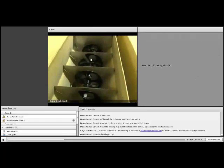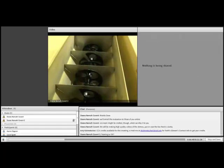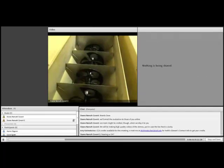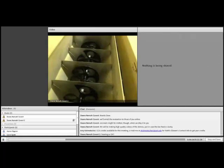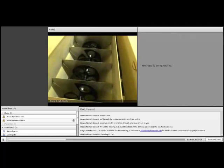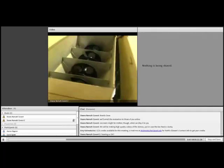As you're looking inside of that fluffy seed box, those paddles do a very nice job of moving the seed around and distributing it down into the drop, which then transfers down through the tube and down between the double disc openers.